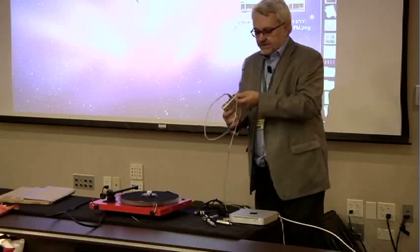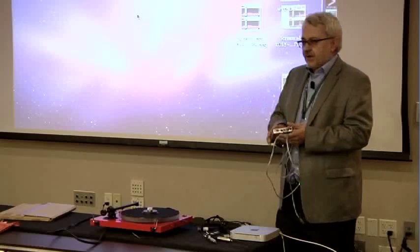What you get at higher prices is better quality clocking in the device, lower noise circuitry, lower noise preamplifiers. The more expensive devices generally actually have fewer features in terms of the electronics, because most of the pro audio people that use these higher priced converters have particular requirements for those other pieces of the preamplifiers. So the higher end analog to digital converters are typically just line level input. The less expensive ones designed for home recording studios typically also have preamplifiers built into them. And those preamplifiers are really quite nice, again, given the price point.